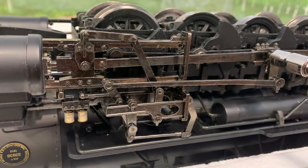This is how I'm hooking the meter to the locomotive — on the one connector that goes between the locomotive and the tender. Those two connectors right there are track power. I just plug these fine wires in there, and that allowed me to connect my meter to it so I could go looking for this short.